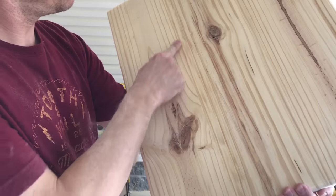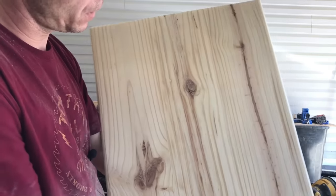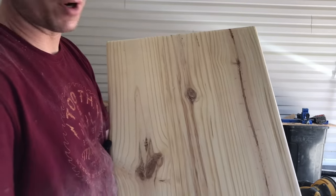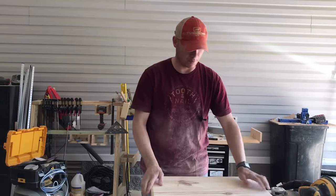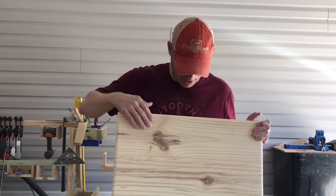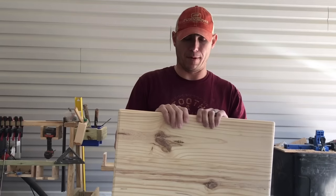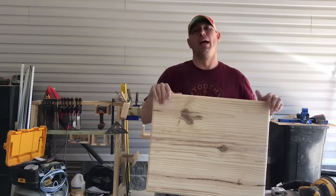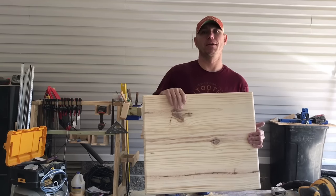Right here's one joint and right here's another joint. You can see the lines if you really look. I'll turn these knot holes up on purpose because the customer wants that look. We're going to stain this dark walnut and it's going to be really pretty once we get all the finishing on. I just need to blow it off with the air blower, then take a damp microfiber cloth and wipe all the dust off, let it dry, then put the pre-stain conditioner on.